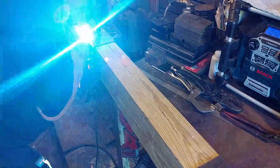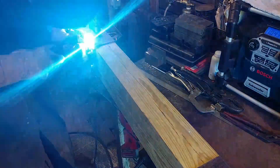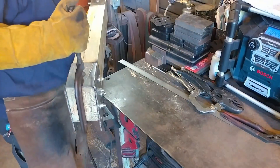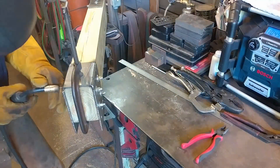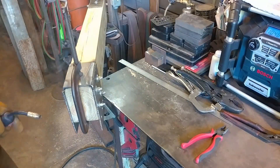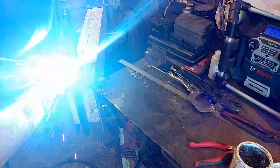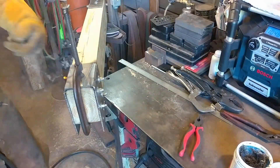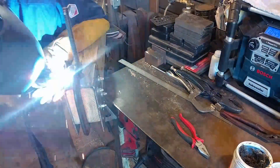I got my piece clamped up and now you're seeing me tacking this up — I went ahead and welded all the way through. You're really going to want to take this back off to actually weld it solid, because I was getting porosity in my weld from the wood burning underneath and off-gassing up into the molten weld pool. That's definitely not good. You can see all the trouble I'm having with it here. Don't do like I did — you can see it off-gassing and burning. I had a terrible time getting this welded, but the camera was rolling so I went to town.